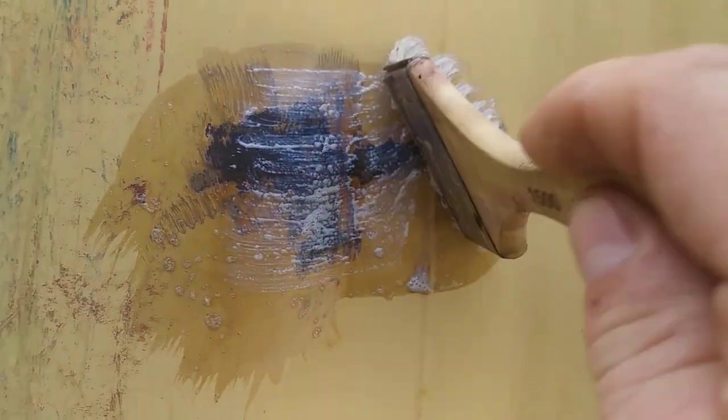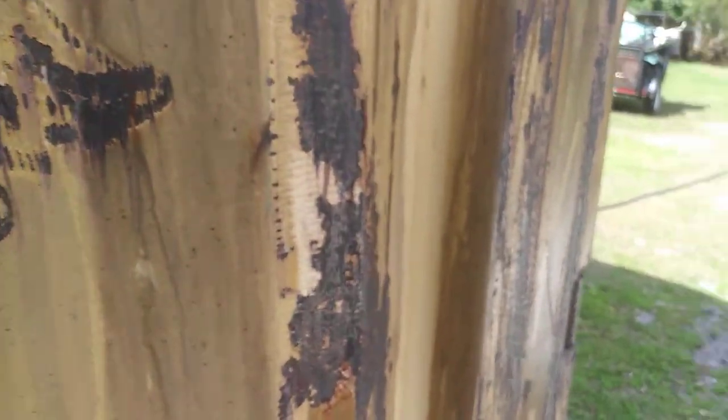It needs to sit for 20 minutes. After those 20 minutes you'll start seeing a chemical reaction — it looks like the rust is darkening. You'll go ahead and rub some more solution on that area, then let it sit again for another 20 minutes and put on another application. From there, it cures over a 48-hour period.